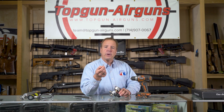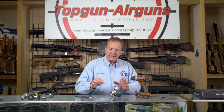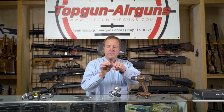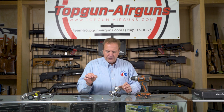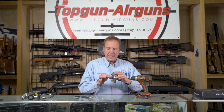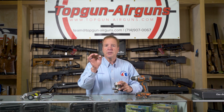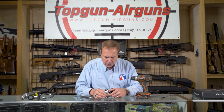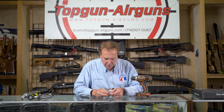This is basically a needle and seat arrangement. For those of you who've worked on carburetors, you know a needle and a seat — basically when the needle goes into the seat it blocks fuel flow, or just like on a toilet bowl, the needle on the seat restricts the water coming out. When the needle comes up, water flows. It's very similar in the TJ3 valve. When air is being blown into the tank, the air pressure pushes the needle out of the way. When you stop filling it, the spring pushes it back into the seat and it effectively blocks it off — except for this little tiny scribe mark right here.